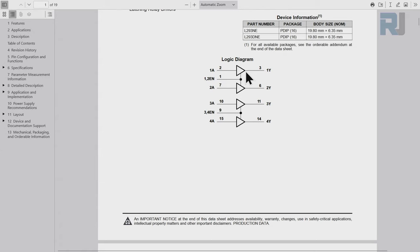Once reaching 255 (maximum), the motor stays at that speed for two seconds. Then duty cycle starts at 255, decrements while it is greater than or equal to zero, printing and sending channel A with decreasing values and channel B at zero, with 50-millisecond steps. Then another two-second delay before the loop repeats.